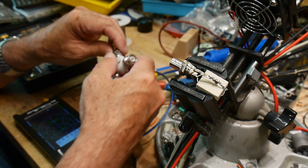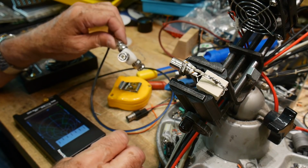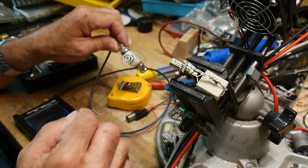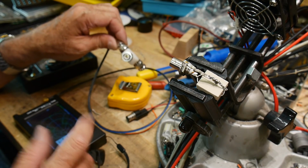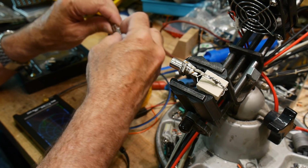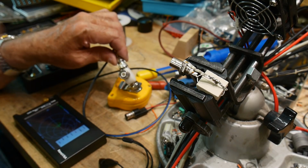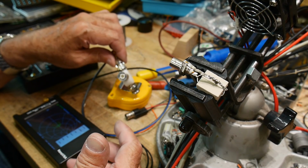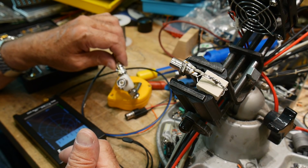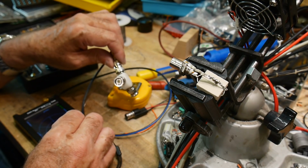Okay, I'm calibrating here. Let me stir up the shorts. So I have a NanoVNA H4, the 4-inch version, and I'm using the DiSlord software on it. If you don't know about this, go search it out, and what it does is it actually is way better than the original software. It allows 401 calibration points, so it's much, much better that way, and just has better software in general. So it does take longer to calibrate because it is calibrating over a larger number of points. So I'm going to say done. I'm going to save that in 4.